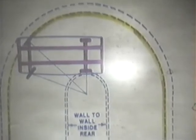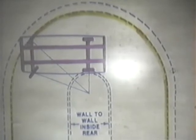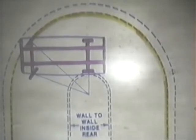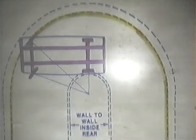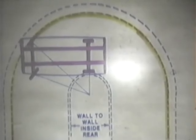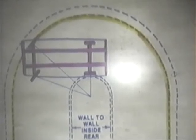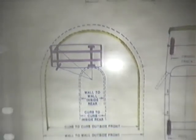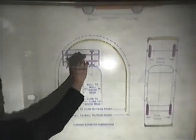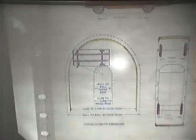It won't matter. Take the tape and get the person to hold one end, and then slide it along until it meets exactly. Take a spot like an even number, like 30 feet, 40 feet, something you can divide by two easily. 34 feet, pick an even number. Don't make it 34 and 5/8 inches or something like that. Pick it exactly on an even number. And that's just by swinging the tape, with this end held, until the 34-foot mark exactly cuts the outside edge.